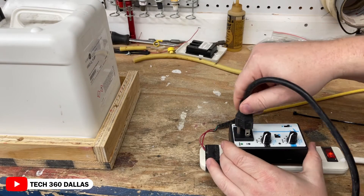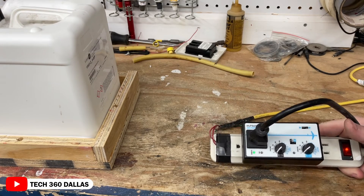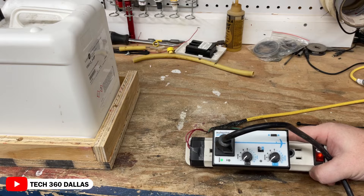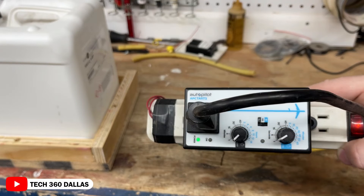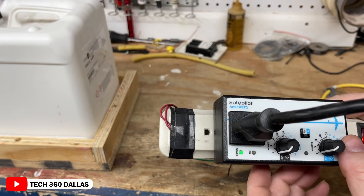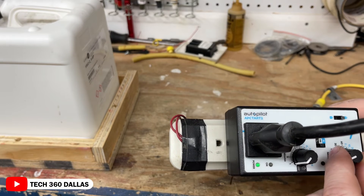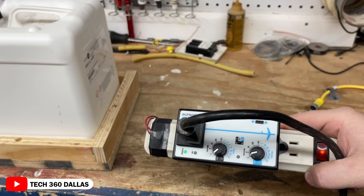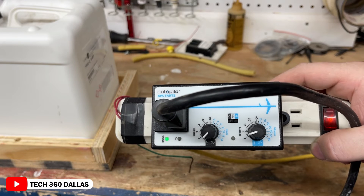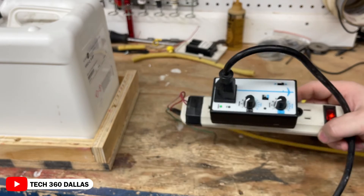Let's plug a little pump in and you'll hear the pump. It's not a traditional motor sound — it's a clicking noise. I've got it set for about every minute and it runs for about a second. I want it to click twice, so I need to turn the on time up just a bit. Let's wait and see. That was four times, so I'll need to back it off just a smidge. Just keep fine-tuning it until it gets right where you want it.